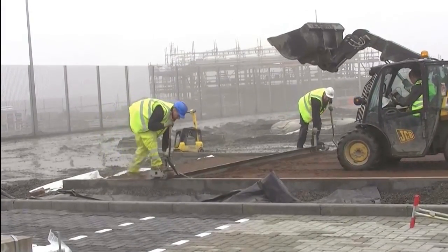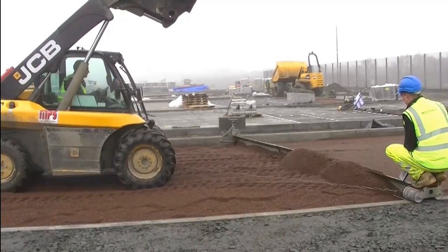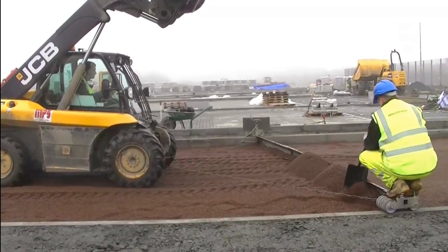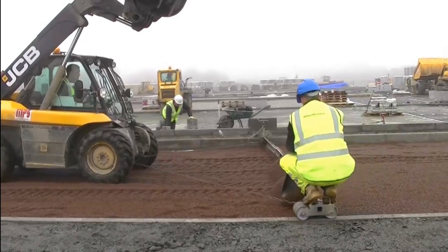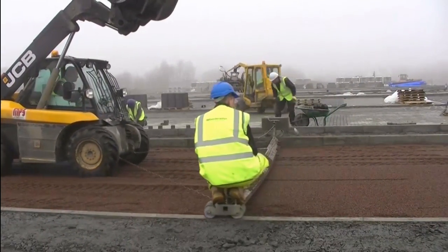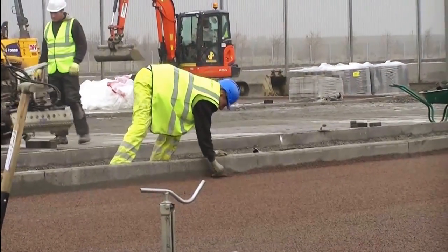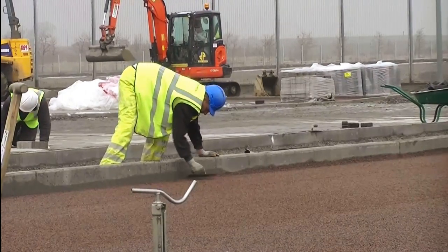The screed system works by setting the screed depth required and by rolling along adjacent curb lines. The mechanical screeding process significantly reduces the manual effort traditionally associated with screeding, whilst considerably increasing the speed. When the screeding process has been completed, the rails are removed and the screed made good by troweling. The laying course is now ready for block installation.